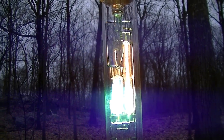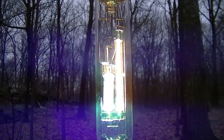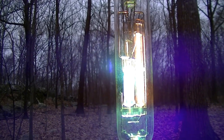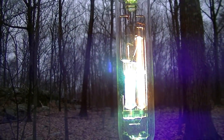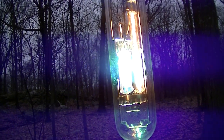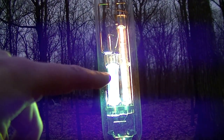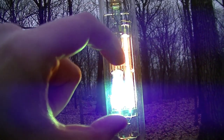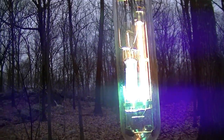These lamps are also available in a 400-watt version, but I didn't get those because of the power ratings. One of the unique things about blended or self-ballasted high-pressure mercury lamps is they are actually brighter on startup than once they've reached steady-state operating conditions — but that comes at the expense of much higher power draw on startup. This one, when I was testing it on 240 volts, started at about 400 watts, which is where my estimate of the halogen lamp rating comes from. The mercury tube, once the discharge has struck and it's still just a diffuse cloud of mercury plasma coalescing into a steady-state concentrated arc, is only about 15 to 20 volts.